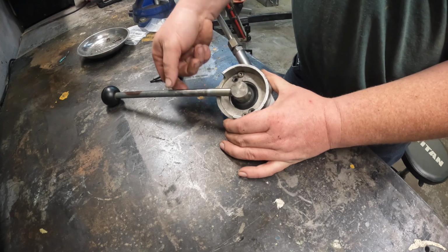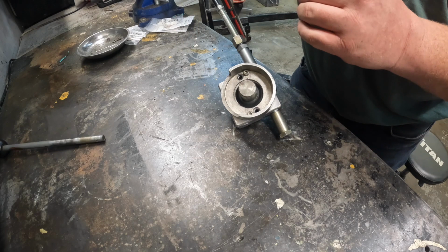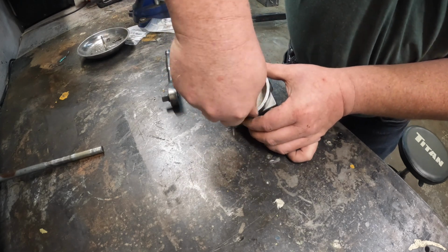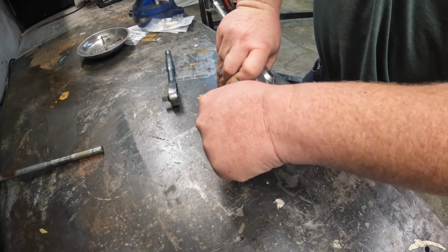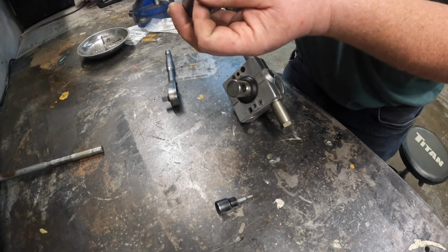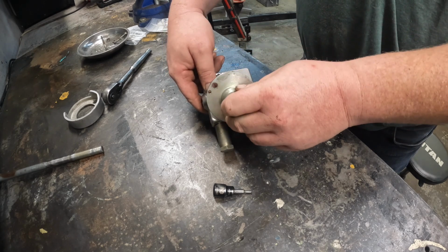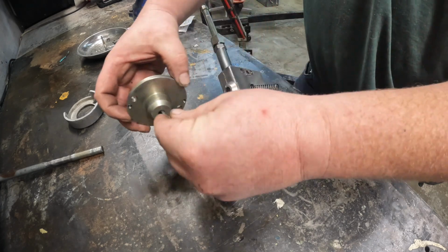Also, there's a roll pin right here that connects this handle. I already have it out from multiple times taking this apart. So pull out. So these two screws go right to the back into this plate, and this is spring loaded. Let's hold that. That's out. This plate can come off. That's the side. Now to get this piece off, this here unscrews. This is what forms your safety release underneath. I'll show you when we get inside.